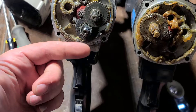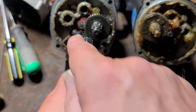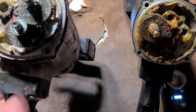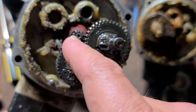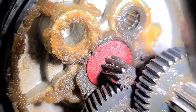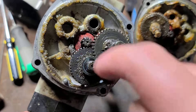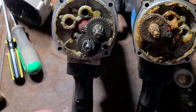Because of the direction they're going, the helical gears are corkscrewing — if you were to put your finger in the gear teeth they'd draw it towards the back of the drill. What can happen is any grease in those gears gets driven towards the back of the motor. They have little grease slingers — a washer specially cut with little fingers that sit right down under the gear teeth. So any grease driven towards the back hits that slinger and spins it out instead of going through the bearing and flinging out of the gearbox.